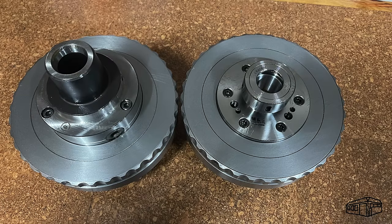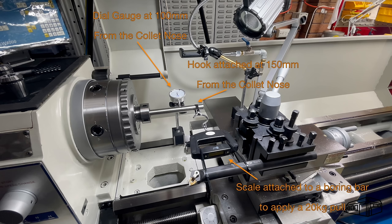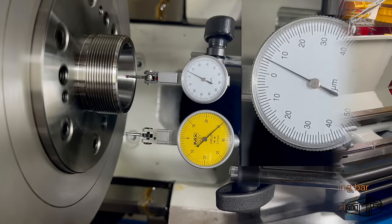All in all, I am happy with the builds. I used an end mill, an old arbor, and a test bar — it would have been preferable to use gauge pins, but I don't have a set. The 5C collets I have are not branded, but they did provide some good outcomes and I am very happy with them. The indicators often did not agree on what they were measuring — a small movement of the 100th indicator was at times followed by a 1000th indicator that visibly appeared disproportionate, which raises the question: which would you believe? The test dial indicators I have are not good enough at this level, except for the Moran right. I think maybe it is time to invest in some Mitutoyo or similar indicators.